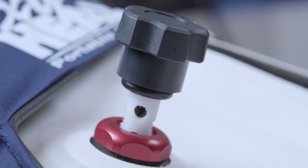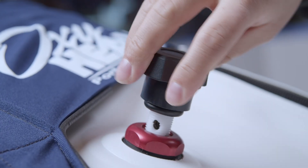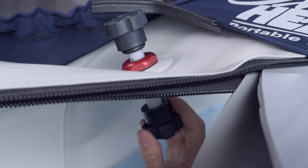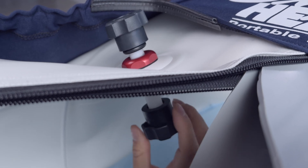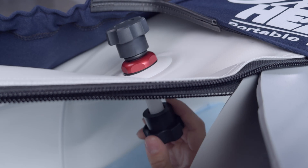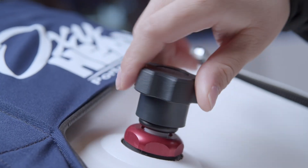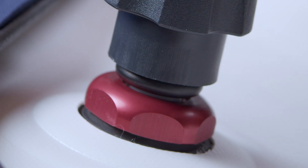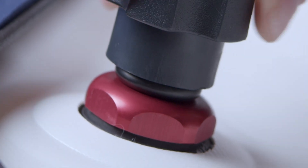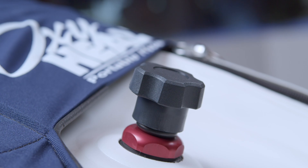This is your relief valve. When it is out like this, the air escapes the chamber to relieve pressure. By turning it clockwise from the outside, you can assist someone into the chamber. From the inside — and you can see it's double-sided — you can turn it counter-clockwise to close, to seal and pressurize the chamber. There is no need to over-tighten it. There is an O-ring at the bottom; all you need to do is make sure it turns to feel the tension from contact with the O-ring, then turn to make it a bit more snug.